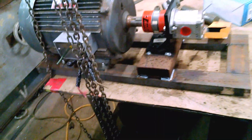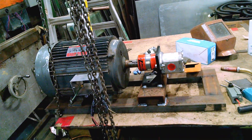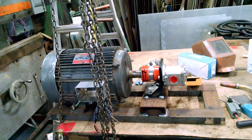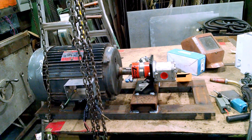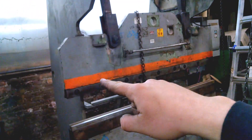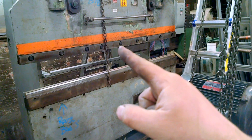Obviously you can see I've been rigging up my motor and my pump. It's a 15-horsepower motor. I should be running about 8 gallons a minute out of this thing, which then reduces down with the 4 to 1 ratio. With an 18-inch stroke on the cylinder but only about a 5-inch stroke on the RAM, my RAM should be running about 3/8 of an inch per second.